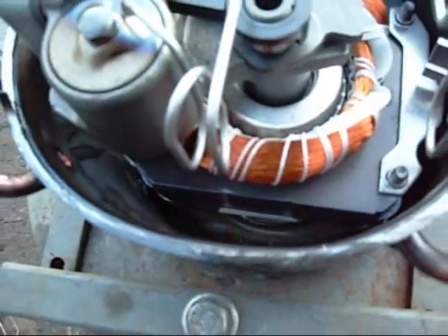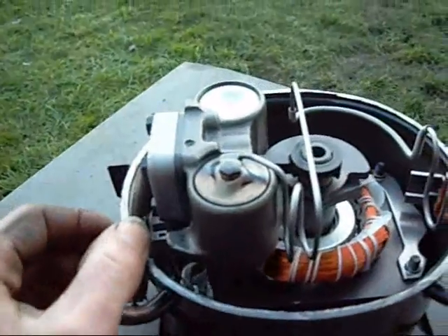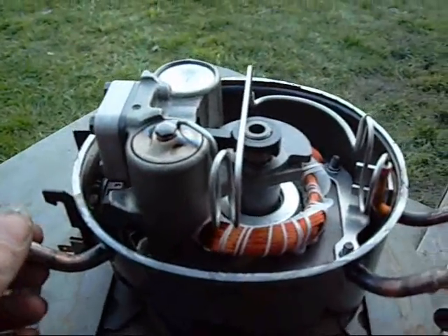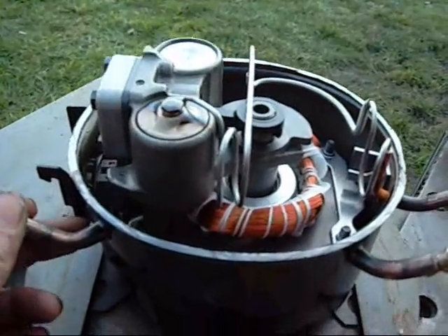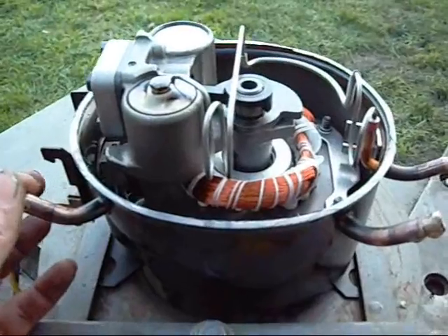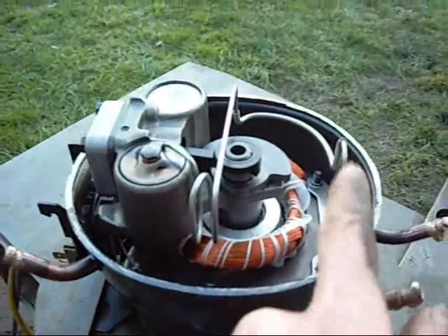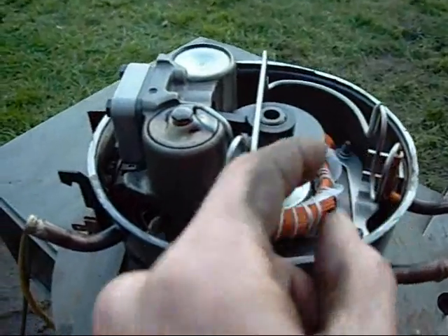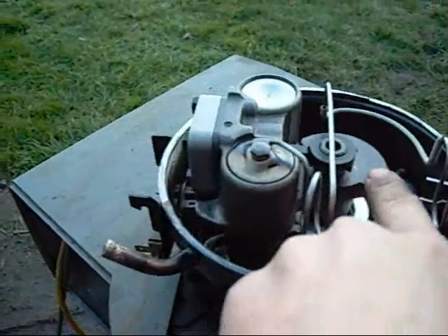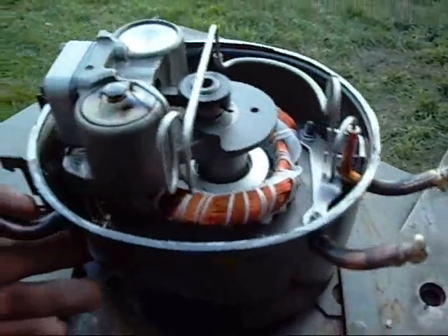I'll demonstrate just how this one works, along with another test that one of my friends wants — possibly how to run one of these as a high start torque compressor. These will not start up under load of back pressure, like if you have a hundred pounds in your discharge line; this motor will not have enough power to start that piston up again. So we've got to look at that, plus a few other little things.